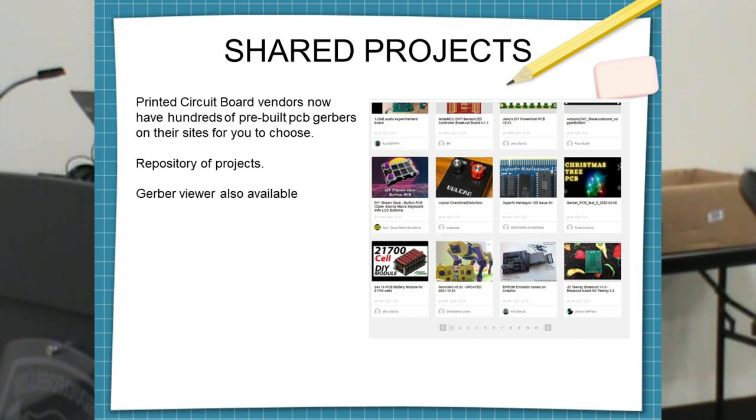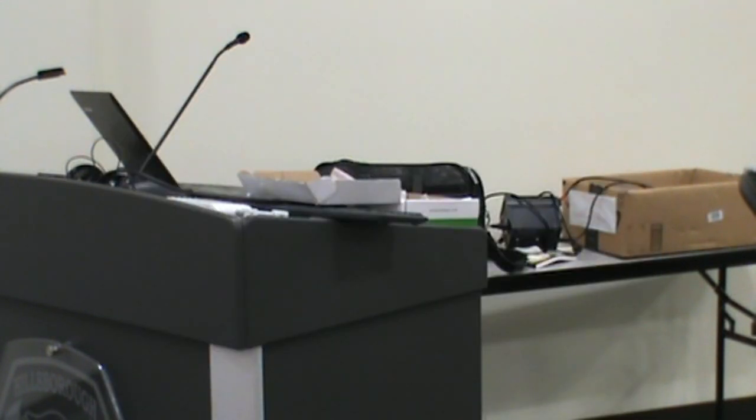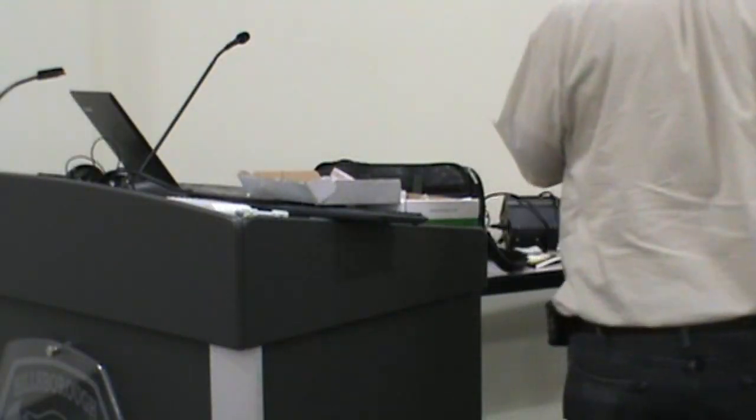One of the things we wanted for field day was a band pass filter so we could run 75 meters and 80 meters at the same time, or run 80 and 40 right next to each other. I made a printed circuit board and we got band pass filters. Building them with toroids and silver mica capacitors took forever. Then we put them inside paint cans — paint cans are cheap at Home Depot, they work nicely shielded, and you can put SO239 connectors through the top. They look like duplexer cans — 80, 40, 20, whatever.